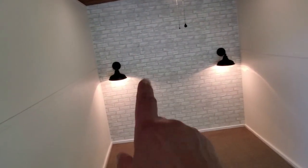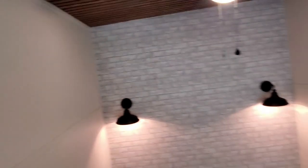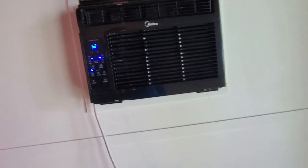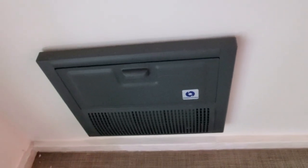Here we are on the inside — it is complete, it's finished. We've gone through our punch list and we're ready to start decorating and bringing in the furniture, fixtures, and equipment. We've got the floor, which is regular pontoon marine woven vinyl, like you'd have on any pontoon boat. We've got our back wall done in heavy vinyl wallpaper, a receptacle and blocking for a TV, a ceiling fan, a 5000 BTU air conditioning unit running at 62 degrees, and our power panel for DC voltage, along with our AC/DC power supply — kind of like an RV power supply with Square D 15-amp breakers.